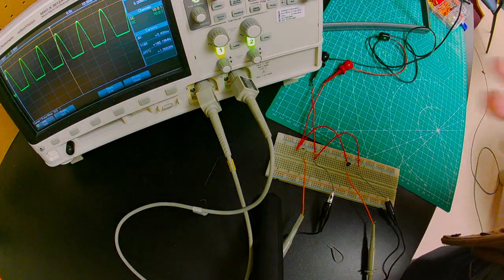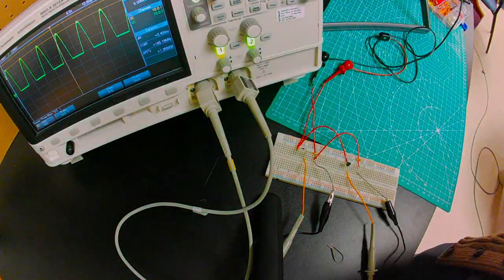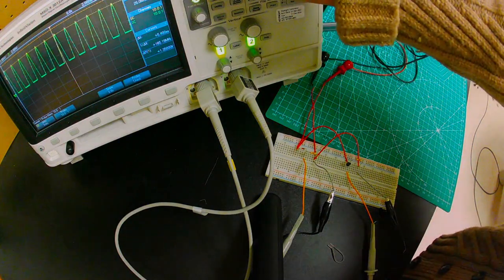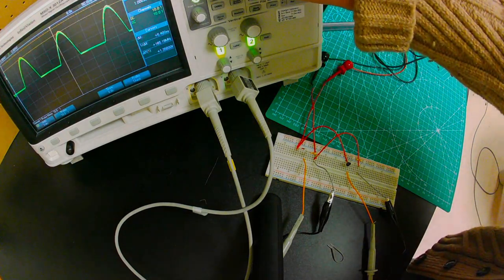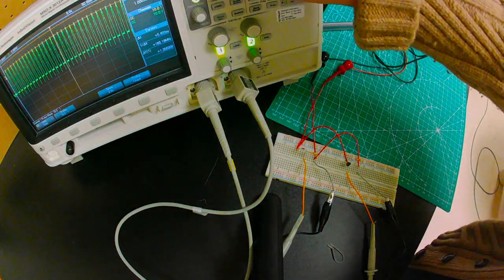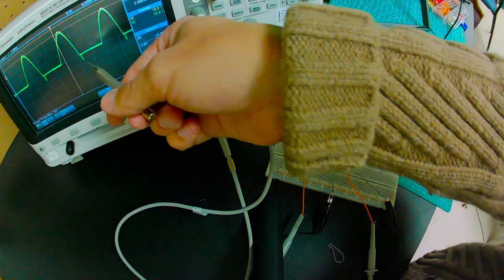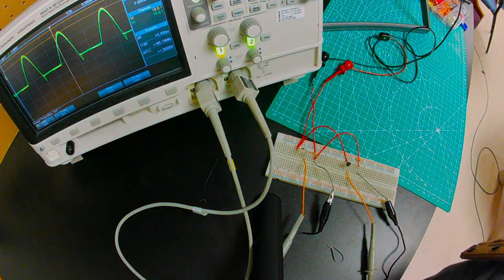And so at first, this seems like it might just work fine, right? That said, the signal frequency is relatively low, 60 hertz. It's a common frequency, but what about for higher frequencies? So as I start ramping up these frequencies, now we're at 600 hertz, still seems fine. At 5 kilohertz, we have some noticeable degradation there. And check this out, at 62 kilohertz, we start having this breakdown here in the negative region, which for a basic rectification circuit would be no good. Very much no good.